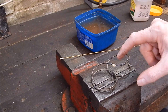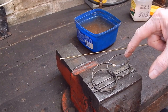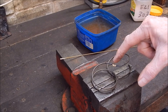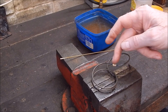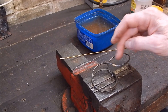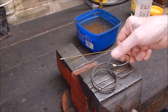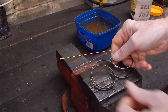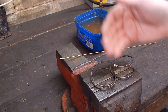That's why you never ever quench high-carbon steel when you're bronze brazing — it will be as brittle as a carrot. Now, if you do have to quench it — the only reason you would quench high-carbon steel would be to get rid of the flux residue — then immediately heat it red hot again and let it air cool, and it will come back to this state. But certainly do not ever quench it and leave it like that. It will just snap.